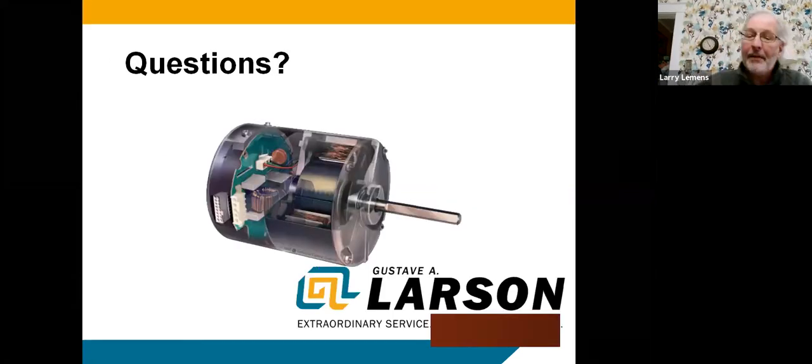We covered a lot of stuff and we're just about at the hour. Any questions, feel free to text, chat, or unmute. When dealing with a furnace, it's typically an ECM motor. On the newer communicating motors, when the motor goes bad you can't make the furnace run — the board is looking for communication. The nice thing with CTM or X13 motors is you can unplug the motor and the rest of the furnace will continue to run. If you're in a pinch and want to throw a rescue motor in overnight to get some air moving, you can usually do that on the CTM setup and the board won't even know the difference.